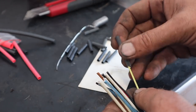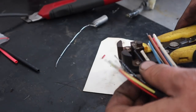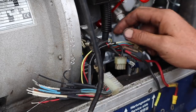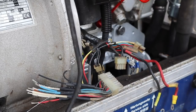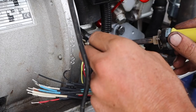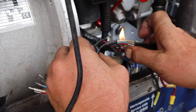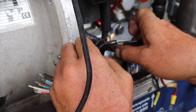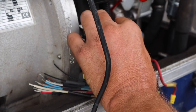This probably looks more complicated than it is. Even though some of the cables here have the same color, they are going to different places on the connector. So I'm just going slow here, soldering one cable at a time, making sure I have the right one for the correct position. And of course, heat shrinking insulation to avoid corrosion and protect cables' connections from each other.